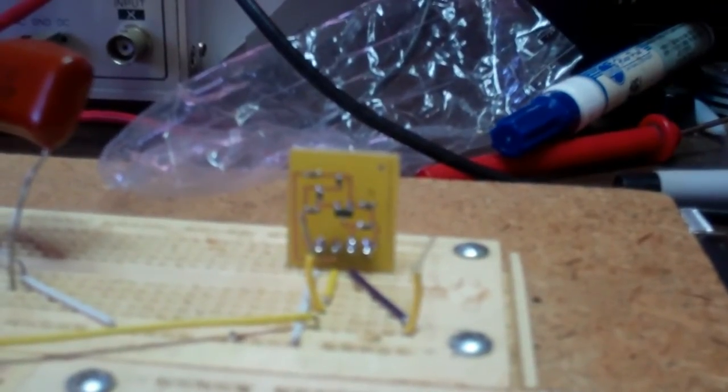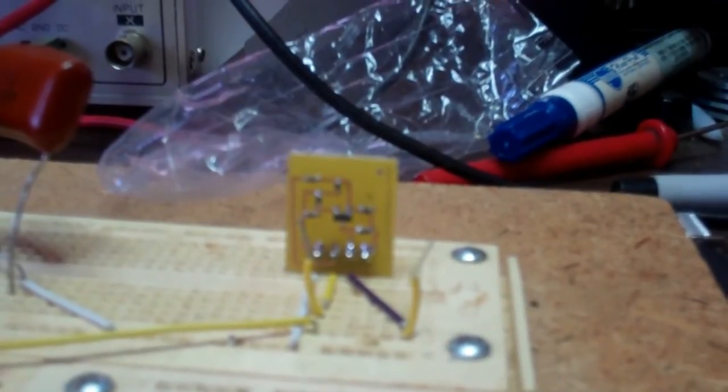I'm going to build a couple more of these and see how far I can take the gain up, and maybe even go so far as trying to build a simple little AM radio receiver. I'm going to spend a little more time and document my circuit board building process — this will just be my own particular spin on it. The technique I'm going to use here uses press and peel blue, which I've used for many years and done all the way down to 0.4mm spacing, though that smaller size is quite challenging. This board uses SOT-23 and 0603 components, so it's a lot easier to do.